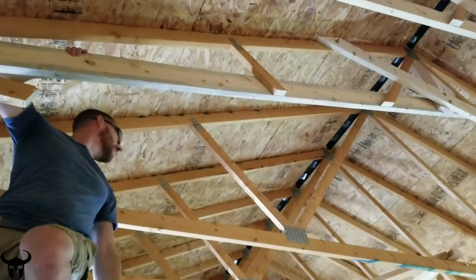As you can see, we basically just straddled the existing trusses with the new design, the new trusses, and then we slowly cut out pieces of the old trusses one by one, which was a pretty safe way of doing it. We then filled in the open spaces with the new trusses, and this was pretty safe now because it's the middle of summer, so there's no snow load.